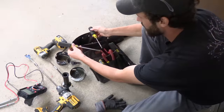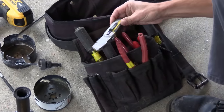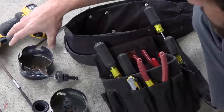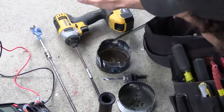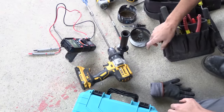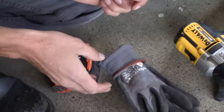I want to point out the tools I used to accomplish this project. Got my electrician screwdriver — large flat head, Phillips, small flat head 3/16, and a number one square drive. Got my wire strippers, utility knife for stripping the outer jacket of my cable. I used my small lineman's a couple of times. Carbide hole saw for cutting the plaster inside, with a mandrel and pilot bit, and a wood hole saw for a nice clean cut on the front porch — I love the Lenox brand. My impact with a couple of extensions and a Phillips bit helped me mount the fan, my DeWalt 20-volt XR with a handle extension and a drill bit to navigate the framing obstacles. My Kaiweets tester to verify the work, Klein tape measure for finding center on the ceiling, Maxi Flex gloves, and the CC laser level.